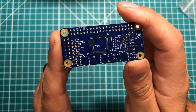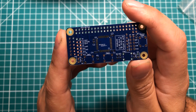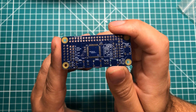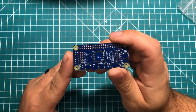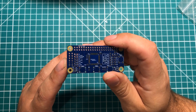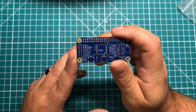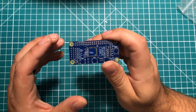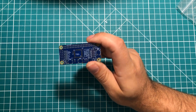The thing you may notice is that it has a bunch of SMD components on it, including that chip right in the middle, and I suck at soldering that kind of stuff. So I am taking my first crack at reflow soldering in a toaster oven. I've seen a bunch of videos on modifying toaster ovens, looked at buying that two or three hundred dollar one off Amazon, but every once in a while somebody says you should just use the thing unmodified. I've figured out there's a common set of things people do to make these work unmodified, so I'm going to try that right now.